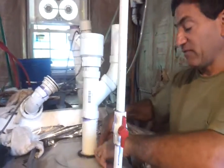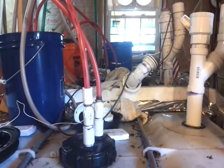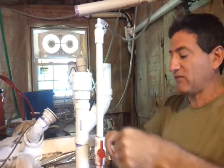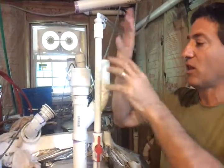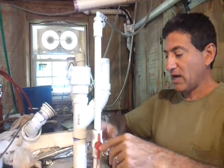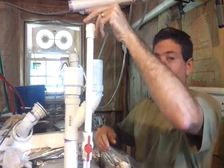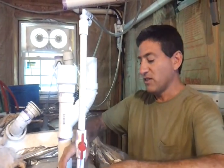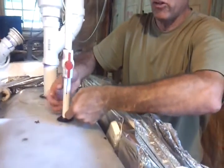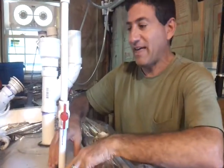It was nice to know that we could remove the pipe and fix it and put it back in. Another thing is we're going to use a 2-inch pipe here — the same size as this — with a cap on that to reduce down to ½". This is ⅜", much too small. You can always use the same size uniseals and pipes, and you can have your valve at the top. You can still use a ½-inch valve to save on money, but use a 2-inch pipe here, and that'll keep the sludge from blocking here, which is why Caffey had to drain it down to get some of that out.